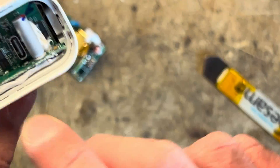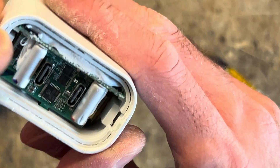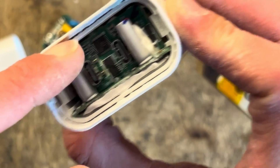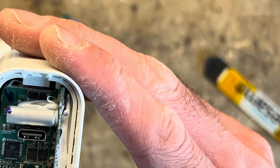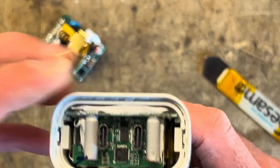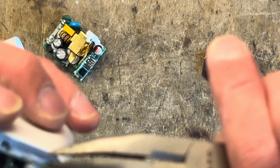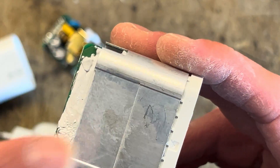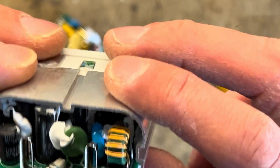Very similar design. I really like that they're putting heat sink compound — it's this white stuff — on the bottom of the board. And there seems to be a carrier inside — this inner plastic thing looks like it's a carrier for the entire power supply, which is of course higher quality. And this is just about 10 euros. If you consider how much it costs, that's way over-delivering. The heat sink compound is very soft. Oh wow — we have full-on metal heat sinking with thermal paste. That's a really nice way of doing a 45-watt charger.